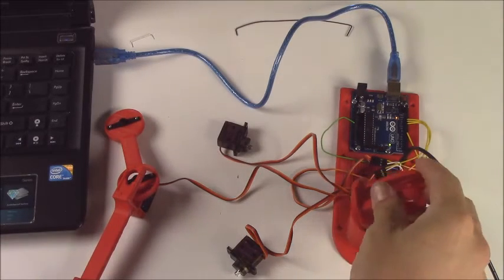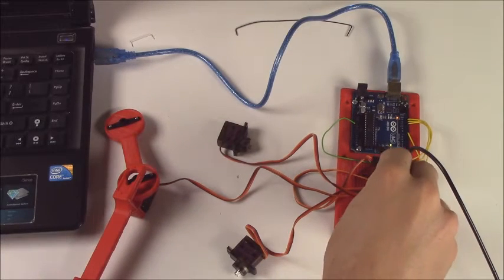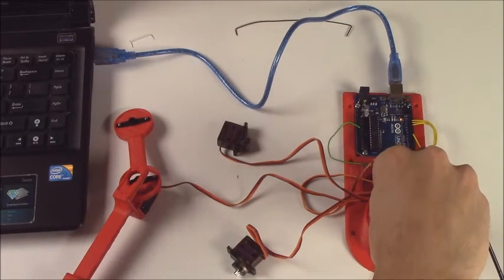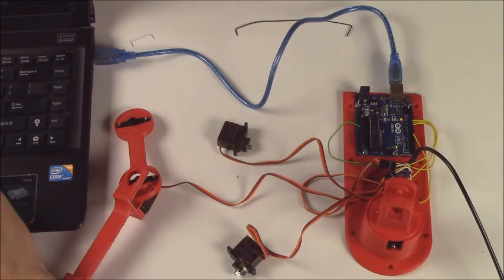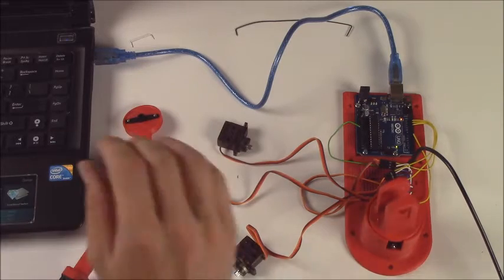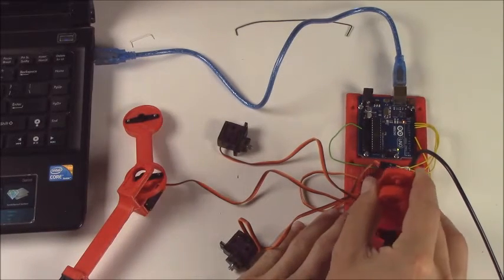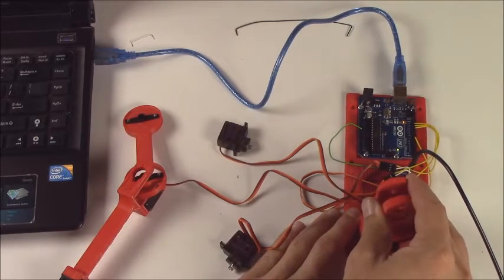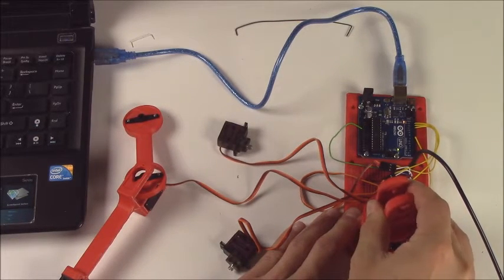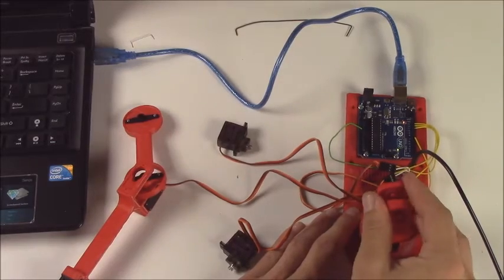So go ahead and pop on the shoulder and then use the GUI to move the servo from side to side. And once you do that, you find the two extremes. Try to get it so that when the servo is at a position halfway of how far it can move, the shoulder is at a position halfway where it can move. You can kind of test it around to see where it goes. You just don't want the arm facing backwards when the servo is moving around.